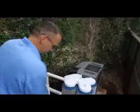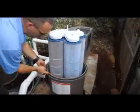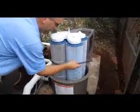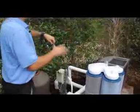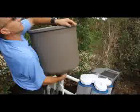The top collector manifold plate is pretty self-explanatory — we've got four holes and then a fifth, so it's going to go like this. Here's the O-ring that you will need to address if you see debris locked up in it like it is right now — you need to take it off, clean the O-ring off, and then clean the seat off for the O-ring. Make sure the seat is clean on the top part of the lid as well.